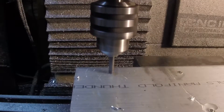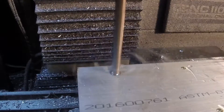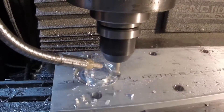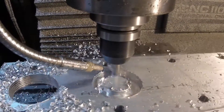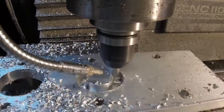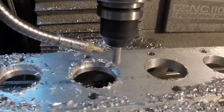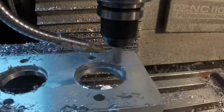Here's our blank. We're drilling for the studs to go through using a 5/16 inch drill — should be just enough room to clearance over those studs. Now we're cutting the bores with a 3/8 inch 2-flute steel end mill at 2854 RPM, 20 inches a minute, and 0.06 depth of cut. Now we're cutting a shoulder so the tubes can be recessed before they're welded in. The finish pass runs at 4000 RPM, full depth of cut, and 20 inches a minute.